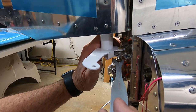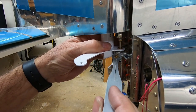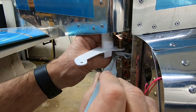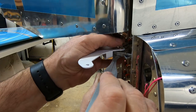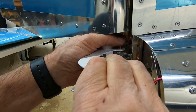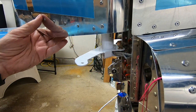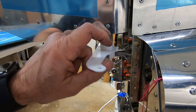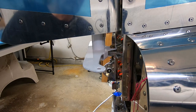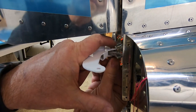Now for the third washer and the inherent rise of tension for the builder. It also goes between the rudder horn and the hinge assembly. The last step is easy. Putting on the fourth washer and the lock nut at the same time.